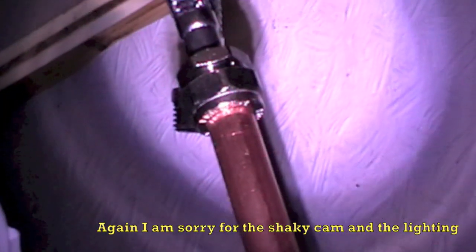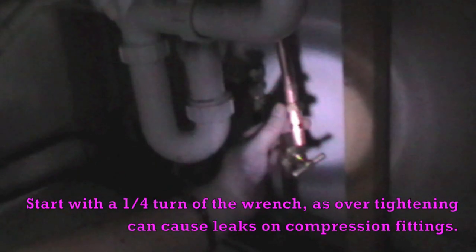As we can see at the top here, the first flexi hose is attached, and that's been attached with an adjustable spanner. I'll attach this copper pipe down here again with an olive and nut. The nut and olive will slide onto the pipe, then place them in position, slide it down, and tighten up — hand tight first, then tighten with the wrench. I'll then repeat the process for the other pipe.